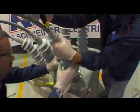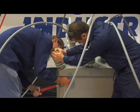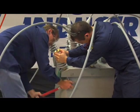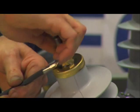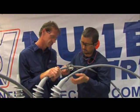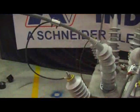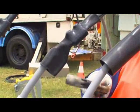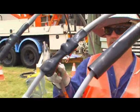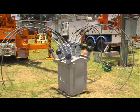Repeat this process for the remaining bushings and cable tails. Once the bushing boots are fitted, the next step is to install surge arresters as per the manufacturer's instruction. Surge arresters are to be installed on the surge arrester brackets located on the source and load sides of the recloser. Surge arresters are compulsory for all overhead installations. Three important things to note: terminations should be made as close to the bushing boot as possible; surge arresters should be fitted to the surge arrester brackets at the torque specified by the manufacturer; and surge arrester connections to the high voltage cable tails should be covered to avoid the possibility of phase-to-phase faults. Once the dressing is complete, dispose of all waste in accordance with your local regulations.